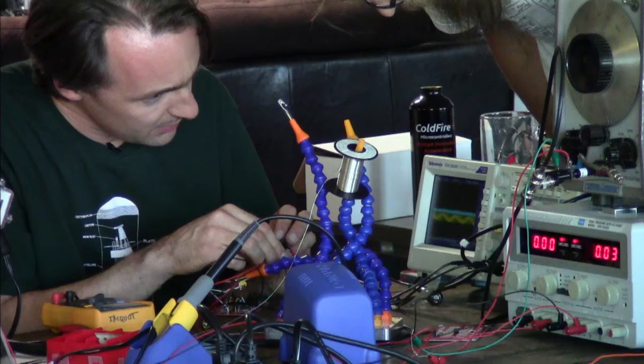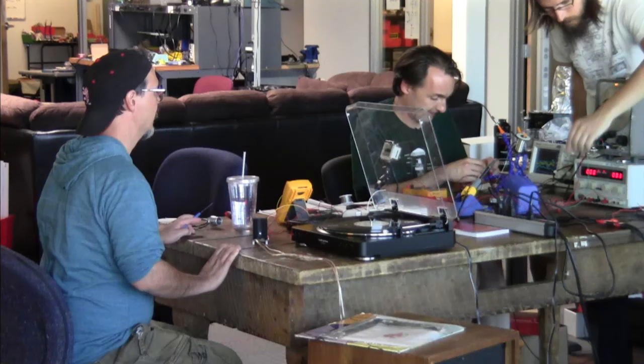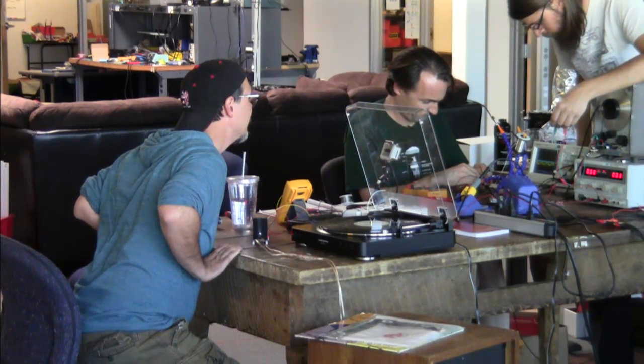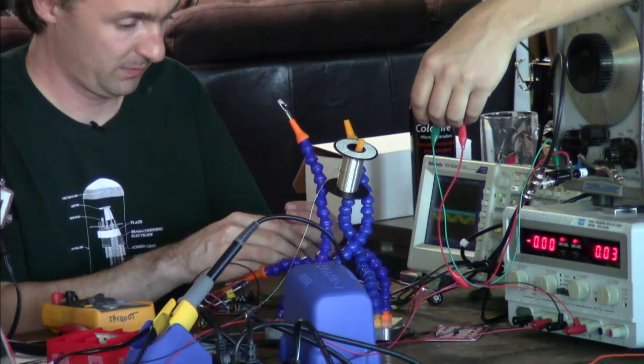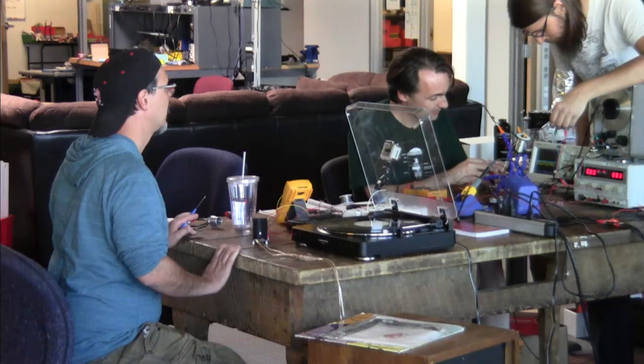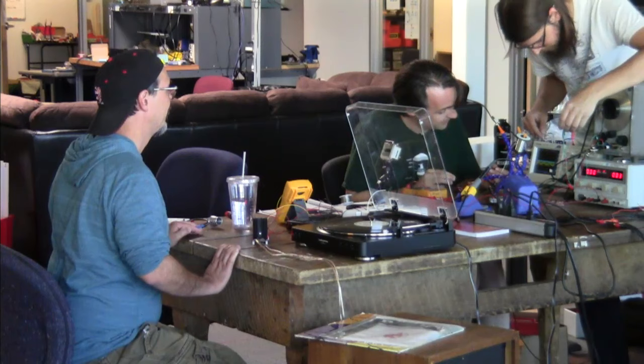Yeah, not seeing. That's kind of weird. Signal from the generator. Coupling DC, no limits. Probes on 10X. The probe is on 10X? These are 10X probes. Well, that explains something, because I didn't change it when I plugged this in. So one of our channels is still configured to be 10X, and that's probably explaining where all the noise came from, too.